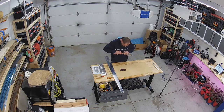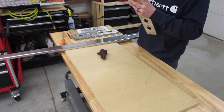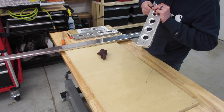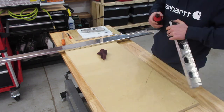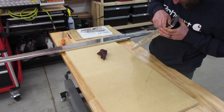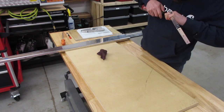I was using a rotary tool here with a conical-shaped fine grinding stone to do the nooks and crannies of the ribs and the spars. In hindsight, I should have done this operation last. There was a lot that the Scotch-Brite wheel on the bench grinder actually was able to do, and I would have just had to do some final touch-ups. I definitely wasted a little bit of time by doing this operation first. Going forward, before I even do fluting, I would actually take care of doing the deburring first, because the marks from fluting change the shape of the metal and then you have to come back and touch up the valleys.